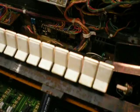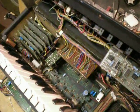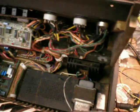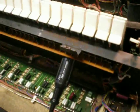I finally got it where you can sometimes reset it once to get the poly section running. It seems to be tolerable now. I'm not sure why it was doing that totally. I had a bigger capacitor in there and that helped. Sometimes chips will glitch when you put too big of a cap in the 5-volt supply — we had 1500 instead of 1000, I discovered.